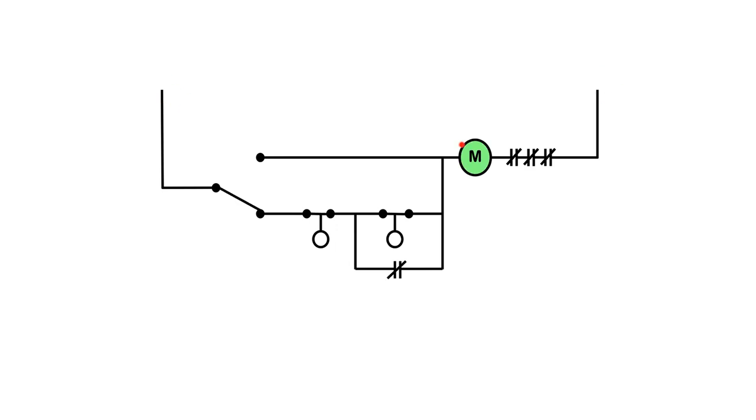As power is returned to our circuit, the M coil is energized and M contacts are closed — the circuit works. What this set of contacts does in a sump circuit or reservoir circuit is it bypasses a float switch. It doesn't hold the circuit open; it's actually there to bypass a certain situation when we have a float. To understand how that works, you should watch either the sump circuit video or the reservoir circuit video. Remember that not all low voltage release circuits look the same. If there's a set of holding contacts, they're not necessarily going to make the circuit a low voltage protection circuit.